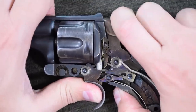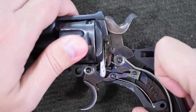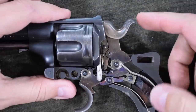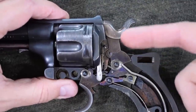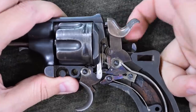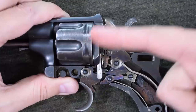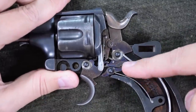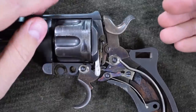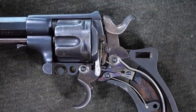If you had fired it and then didn't index the trigger, but instead started rotating the cylinder, which you really can't because the firing pin's dragging, but maybe you're just a gorilla about it. I don't know where these fears are coming from, because to load the gun, to mess with changing up the ammo in the gun, you would have to open this gate, and to open the gate also, oh, look at that. It manually rebounded the hammer into that safe position, which is up off the cylinder, up off any cartridges or primers in there, and also technically hammer blocked, can't push it forward. So this is actually already a thoughtful system, more so even than the Nagant, because no matter what, it's going to be indexed to the rebounded position. No need to have a rebound.